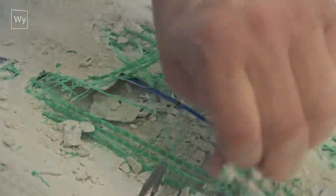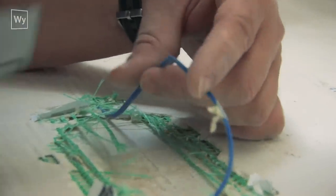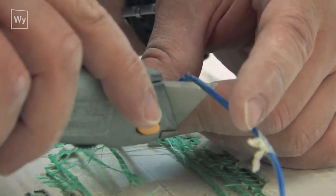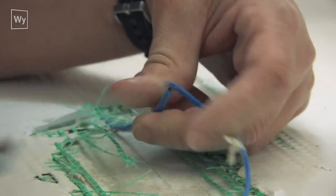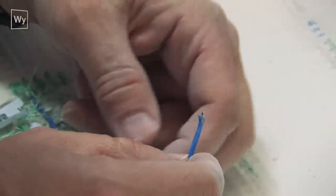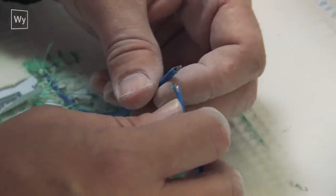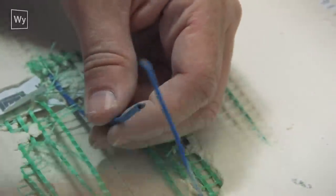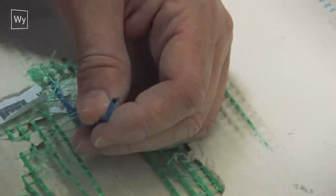Here's our bad spot. We're going to take a blade and just cut it — the wire is no good here anyway — and separate it. I open it up to get at the wires and strip the wire back about an inch on each side so I can make my connections between the two voltage-carrying lines and the ground.